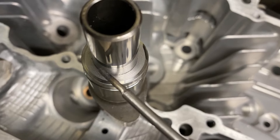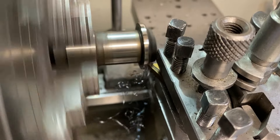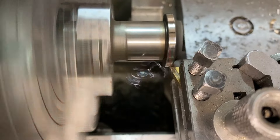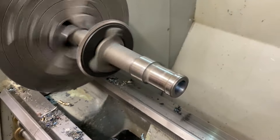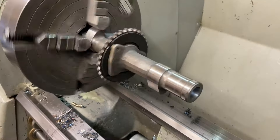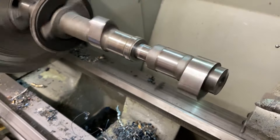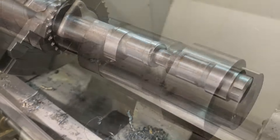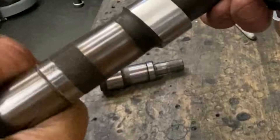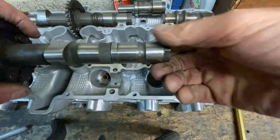If you look closely at the end you can see where the cutting tool has made the outer hard skin shiny and the inner softer core dull grey. With another piece set up in the four-jaw chuck I have to remove some raised bosses - these are really hard and the swarf grows red hot. I then set up the centre portion of camshaft and bore the hole in each end so it's a sliding fit with a gudgeon pin. I run the lathe to check the concentricity and it's perfect - I'm well pleased with that.